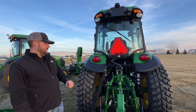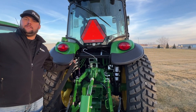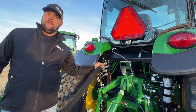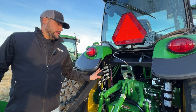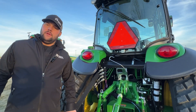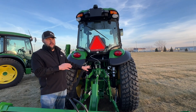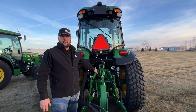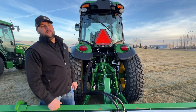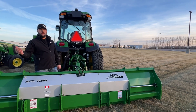For 2024, Deere does not have the downforce kit available yet. Dealers, pay attention when you're building these tractors: your fourth and fifth line kits are different for the 2024 models, and the EH third kit is different as well. Please pay attention — they changed things up in the back end of these tractors. You can still build them, but make sure you get the right kits, otherwise your customer will be waiting longer while you swap kits and you'll be wasting your shop's time.